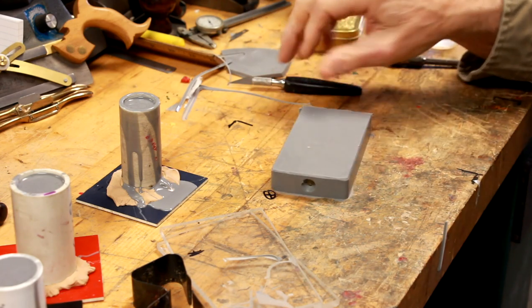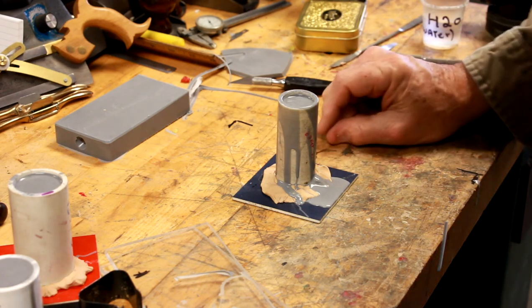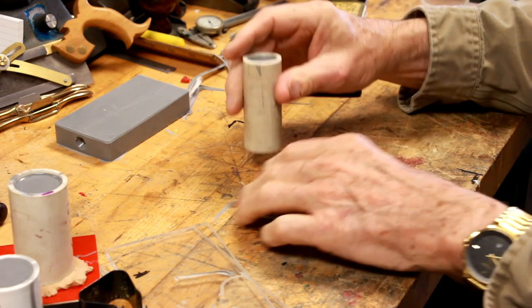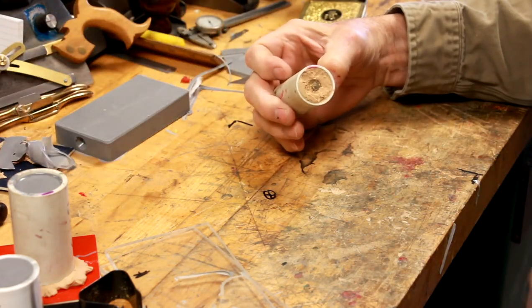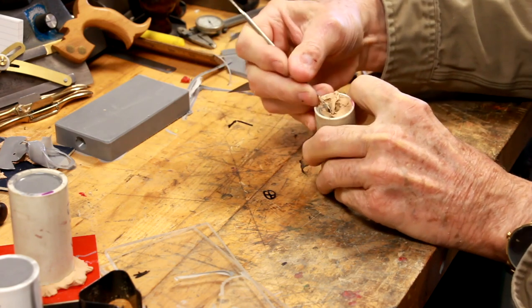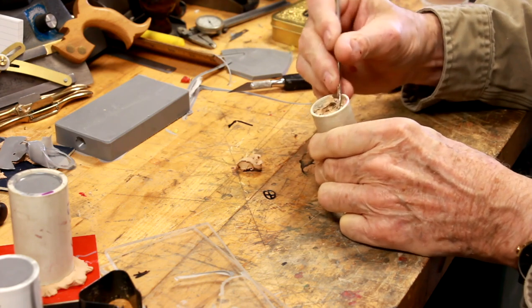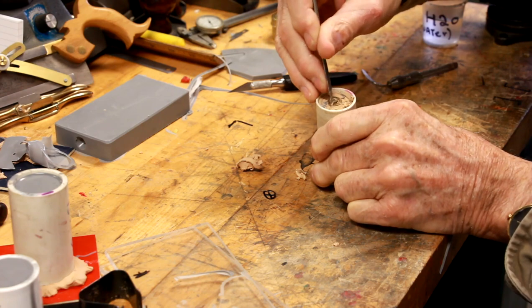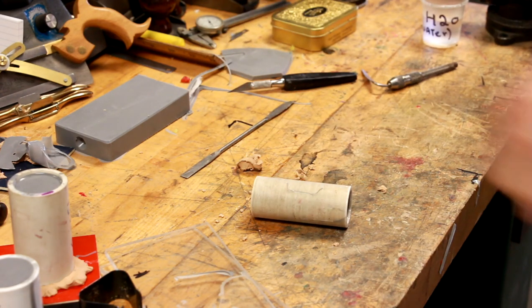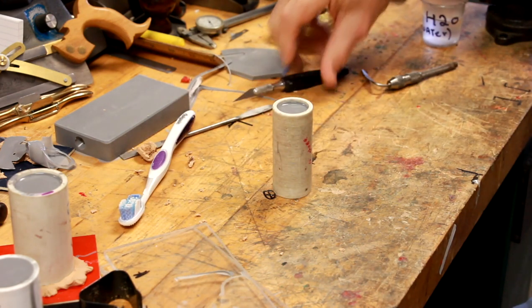This mold is out of the frame now and it's ready to be cut open. But first, let's look at what it looks like to open up one of the round PVC molds. You just pull it off the clay and start peeling off the drippage. After removing the clay from the bottom and getting down to the rubber, I'll go into the top of the mold and cut a little chamfer around the inside.